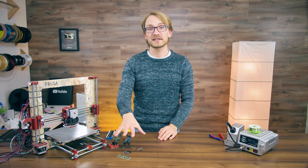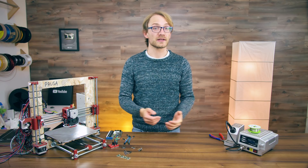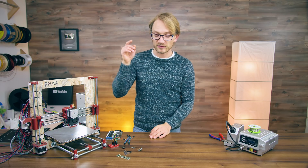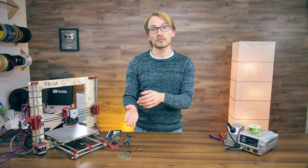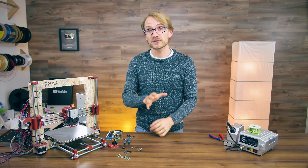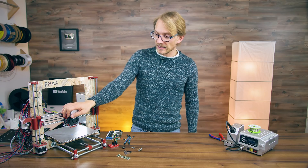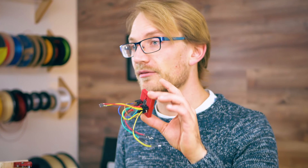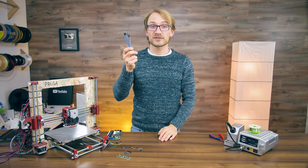At this point you probably know you want some of these, and if you're looking to upgrade your 3D printer, this is definitely one of the best things you can do to it. To follow along you will need: a 3D printer that can run Marlin, obviously; TMC2130 silent stepsticks - you can get these from Watterot in Germany or from Filastruder in the US. These are made-in-Germany boards; a full set of 4 drivers will run you about 45 euros or 55 dollars. But you don't have to swap out all 4 drivers - if you want to save some cash and still get like 90% of the benefits, you can just swap out the X and Y axes, which are the ones typically working the hardest. You'll also need some breadboard - I love these little mini ones - and some male-to-female jumper wires. I've linked these in the video description below; this stuff literally costs pennies.